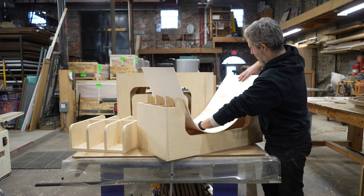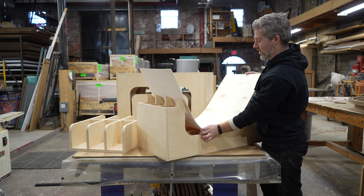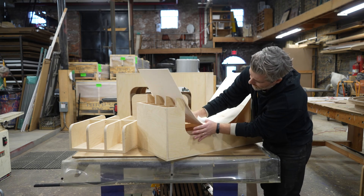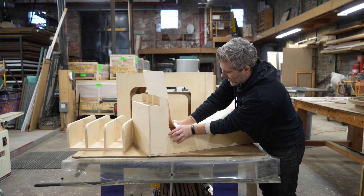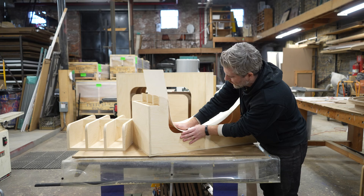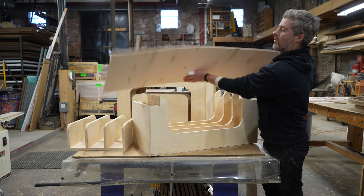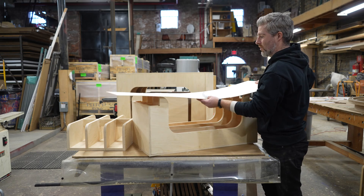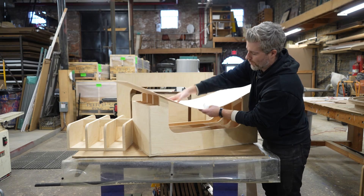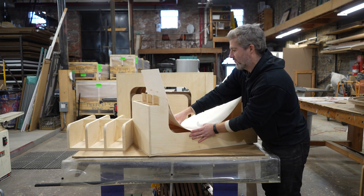I'm going to bend this in and glue it on, and that's going to give a smoother surface for the jig. We were worried that the bendy ply was not going to take that curve — it might snap because it's a 90 degree curve. Hector came up with the good idea of leaving these pieces of plywood out in the rain to loosen them up so they'll be more likely to take that curve, and then we can glue them on and finish off the jigs.